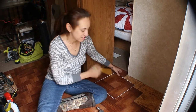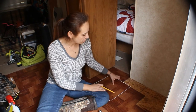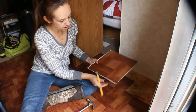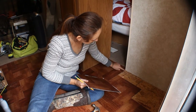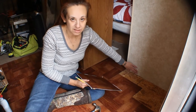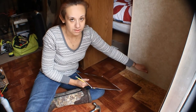When you're cutting your tile to fit at the very end, some people say it's just as easy as laying the tile and cutting right here — wrong. You want to make sure that the nice manufactured line is your straight edge that's going to fit onto the tile next to it. You want your cut closest to the wall because you're going to cover it with your baseboard or whatever you're installing, and you want your cut to be hidden — not out where everybody can see it. So make sure when you're laying tile and you get to these cuts, you hide the cuts right by the wall.